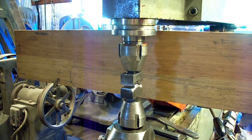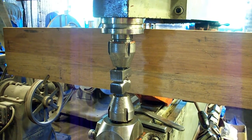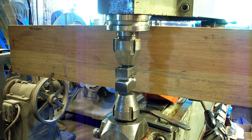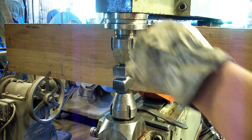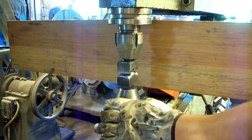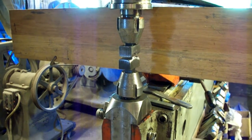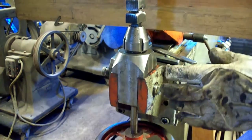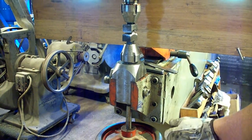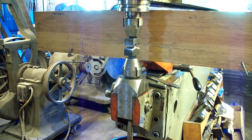I've got an auxiliary fence set up on here — just a piece of wood so you can see what's happening a little better and you don't get any reflection. I've got a pneumatic lift on this machine and at the top it's going to come down. What I like to do is leave the bottom loose, and then little by little I'll inch the hand wheel up until we get a full bead, and then we'll crank it a little bit more and planish it out at high speed. Here we go.